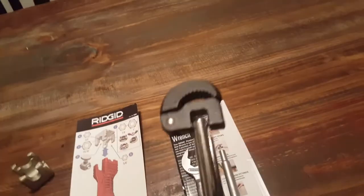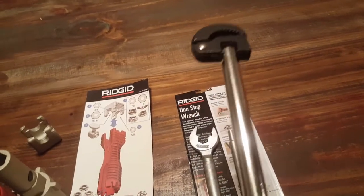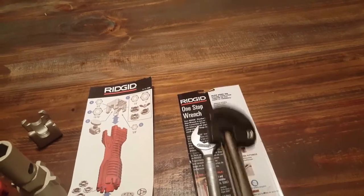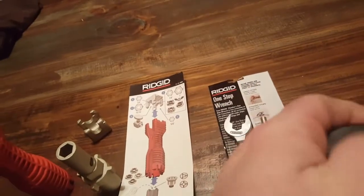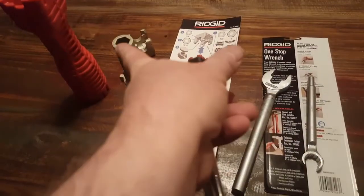So I had to go to this — it's called a basin wrench, otherwise known as a crow's foot as I call it. Other people call it other things, but I've always known it as a crow's foot. It tilts either right or left, you can open it up, and it goes around the older style fittings. What I changed out today, I used newer model faucet lines with a 3/8 bolt at the top and compression at the end, which made things a lot easier.